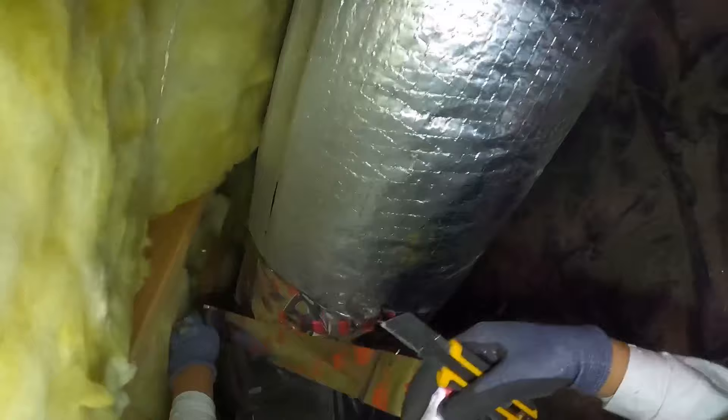This is one of the most secure ways to do it — I buried the tie wrap around the duct with the ventilation duct cover over it for double security so it won't fall off in the future. Now I'm doing some aesthetic work, closing down all the exposed insulation holes with vent tape and securing it to the main section. I know I'm going a little crazy with the vent tape, but I want to make sure it's not coming down. Just don't tape too tight on the insulation or it'll lose its R-factor.